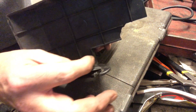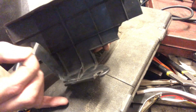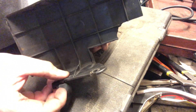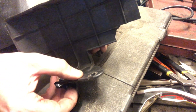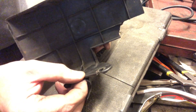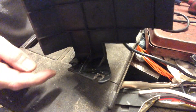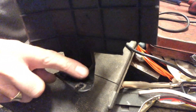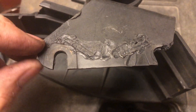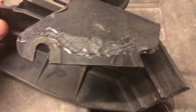To finish off I'll just remove the tip. I think we'll get a zip tie and flow a bit of plastic into these cracks, but it does feel more than strong enough to do the job, especially with the reinforcing. So we've now filled the gap and basically laid the tie wrap on, melted it down its length, and then just worked it in side to side. I'm really pleased with that repair. When it comes to reassembly, just a washer either side will nip that up quite sufficiently.